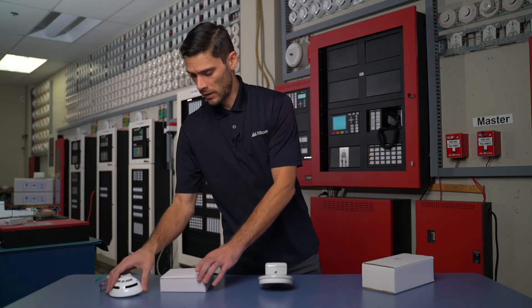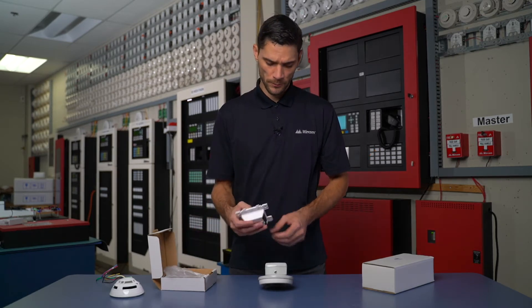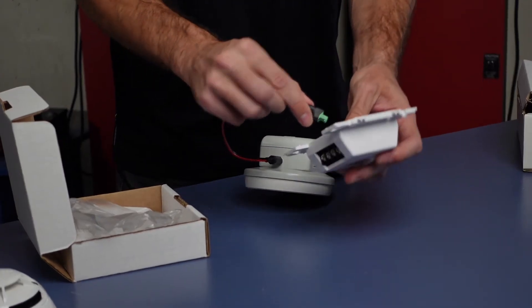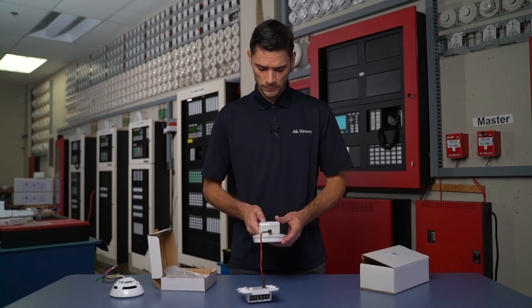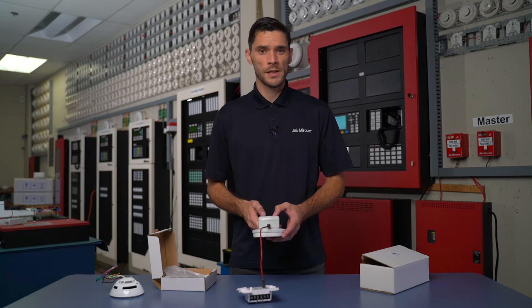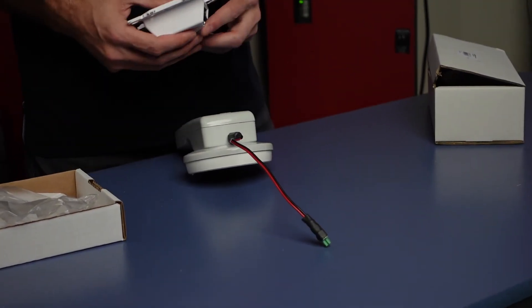So if we wanted to program one of our other modules rather than the mini mod, here I have a MIX 4060. I'm going to need the programming cable again. We're plugging the aux cord into the top portion and then the terminal block into the actual module itself. Once the termination has been made I can turn on my device. Considering this has been right out of the box it should read a no address. I'll use the up or down cursors to select the desired address. For this particular module I'm going to select address three. Hitting the green checkmark will store the address into the module. Now I can disconnect and my module has been programmed.